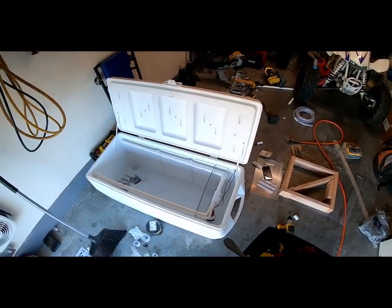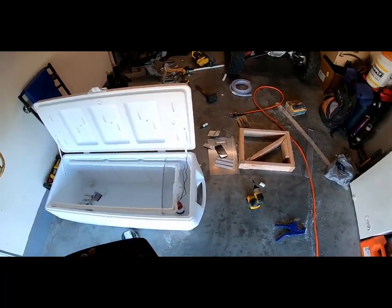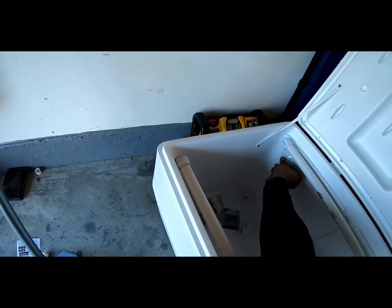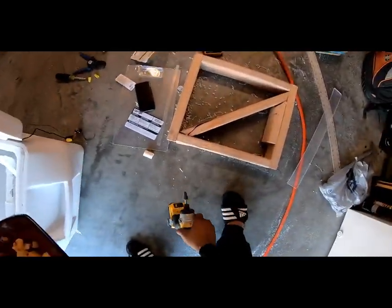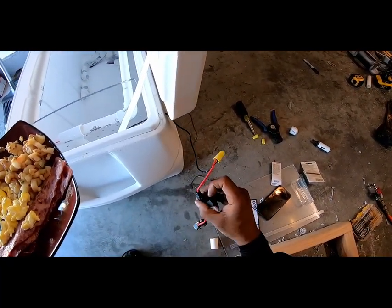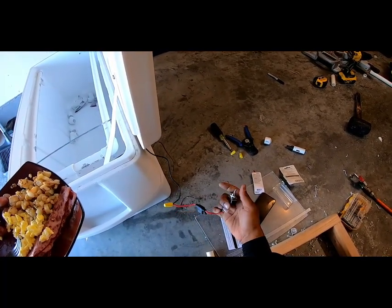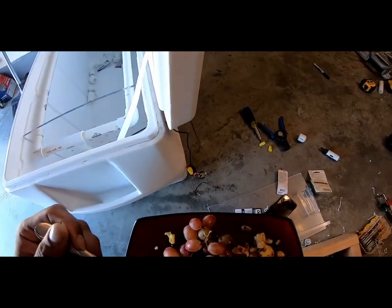It's getting a little late in the morning, so I'm taking what I have and running with it. Breakfast got brought down to me, I rigged everything up and made some little suction cup brackets — one fell though. On the back side I put in a 3-amp fuse, put it on a toggle switch, and I'll run it down to my batteries and to my bilge.